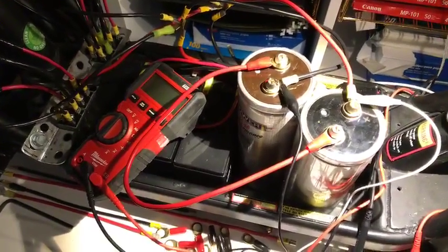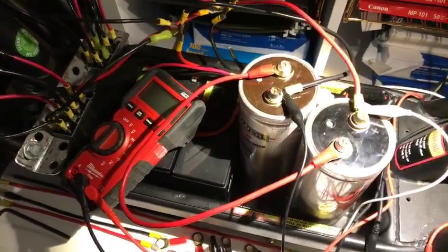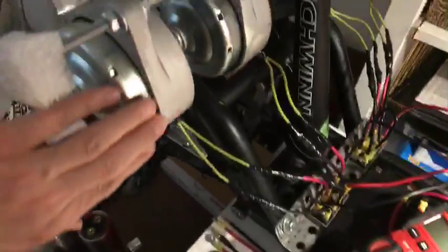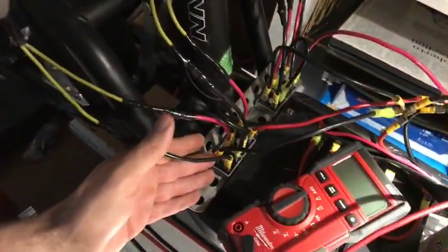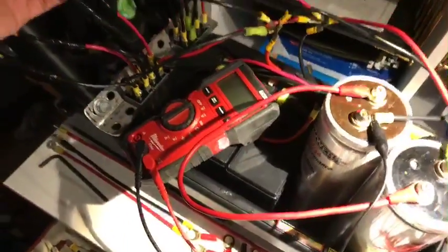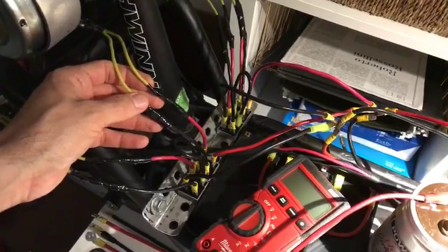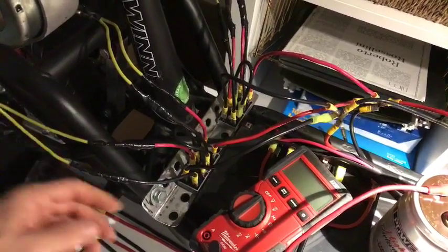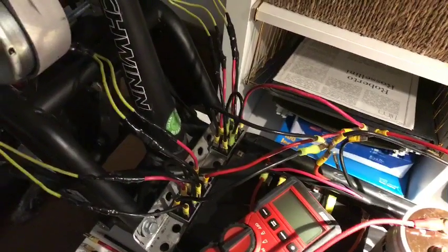Can I go over what Lance had said and just say that we didn't understand it, in case he's still trying to help us? Lance wrote us a comment on one of the videos, and from what I understood, he was asking us to connect the alternator to a bridge rectifier, and then to a capacitor, and then to the next alternator. The reason we're uncomfortable doing that is because if all these alternators are spinning and putting out voltage, sending DC voltage into the output of AC doesn't make any sense. So Lance, if we're misunderstanding you, please clarify.